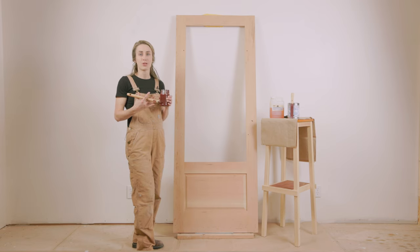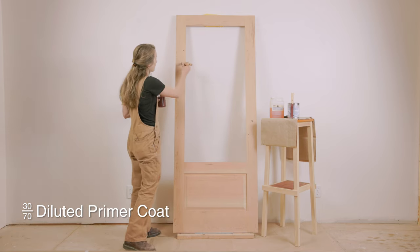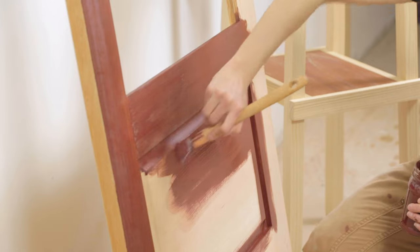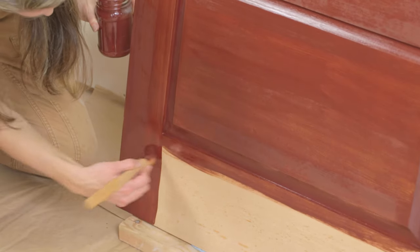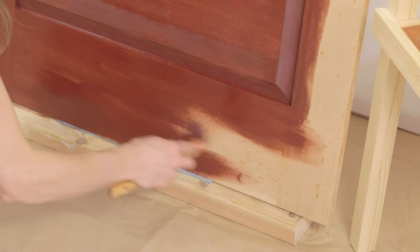This is optional, but the manufacturer recommends it as a great way to get a little extra oil into dry wood before you finish with your undiluted coats of linseed oil paint. I'm going to apply thin coats, and I should be able to visually see it immediately start to soak into the wood. A little goes a long way, so you want to stretch out the paint even when applying this primer coat, which is really a linseed oil stain — meaning a higher ratio of oil to linseed oil paint — and you'll expect some transparency.